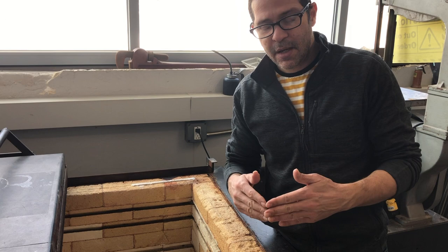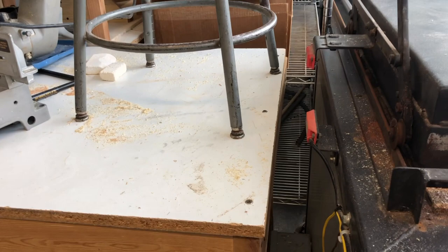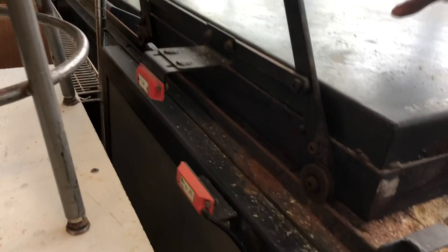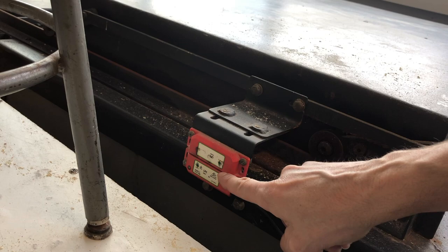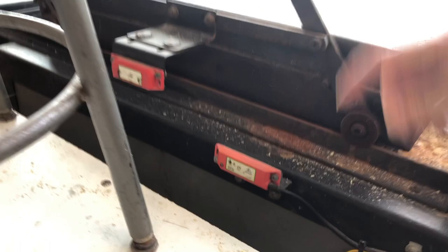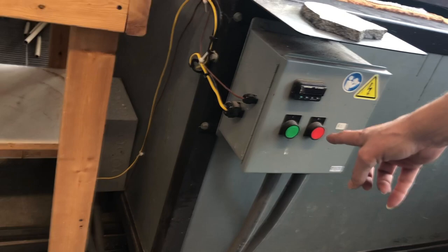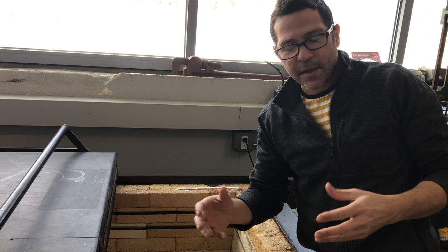This kiln, like a lot of kilns, has an automatic shutoff switch — a way of detecting whether the kiln is open or closed. It has two magnets, and when I close the kiln the magnets come into close proximity and detect each other, and a light comes on telling me the kiln is on. When I open it and break that proximity, there's no more power. To double check, I've also turned my kiln off by pressing this red button.